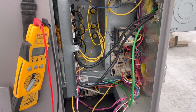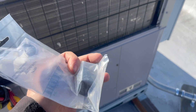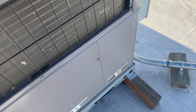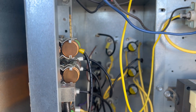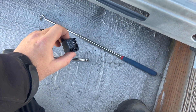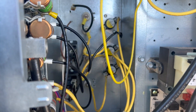That could explain why the breaker was shut off. We're back at this unit with our new relays — going to replace those, repair the wiring, then power it up and see what happens. Got the first one out — it's pretty bad — and we need to fix those ends because they're pretty melted. One down, one more to go. I might just replace that third one too, just to be safe.